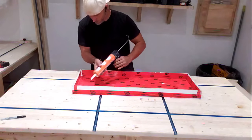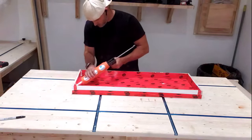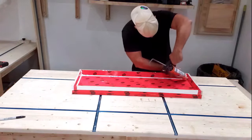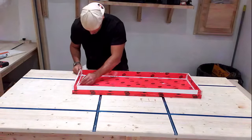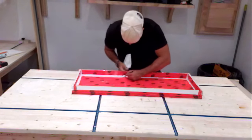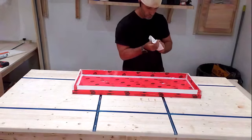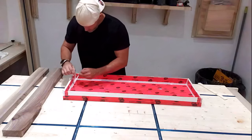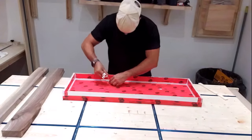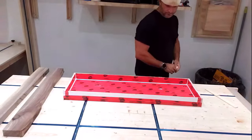The most important part of building your mold is making sure you seal your edges. Silicone or caulking does this really well. Once you've done that, you have to make sure your caulking dries — leave enough time before you put your mold in, because if you loosen any of the caulking you'll create holes, which will cause a blowout and you'll lose a lot of expensive epoxy. I run a black felt-tip marker down the edges of the silicone to clean it up and seal in the edges.